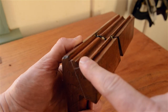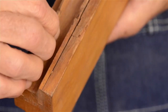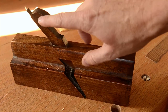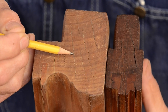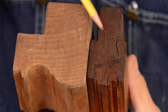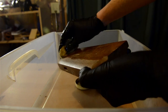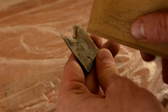Some of these planes have boxing inserts which are used to strengthen narrow parts of a profile, so make sure it isn't loose or missing. All of these problems can be repaired, but you might as well start off with as easy of a molding plane rehab as possible for your first time. I would caution you to stay away from buying a molding plane that has a major split or crack in the wood. You'll have a hard time finding a vintage molding plane that doesn't need at least some rehab work — even the nicest ones will require at least sharpening and some minor tuning.